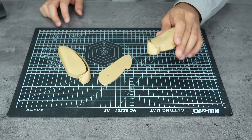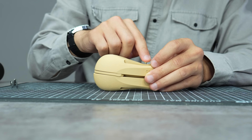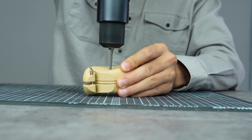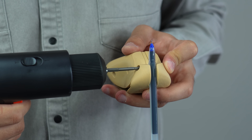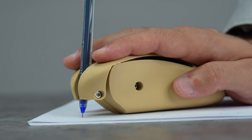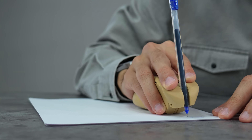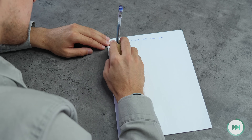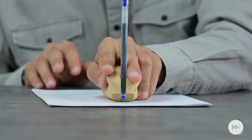Assembly is pretty simple. You just need 3x M3 bolts, and if you want, you can add threaded inserts — I added them because I have my new heat insert press. Then just tighten your bolts, insert your pen, and tighten the last bolt. Instead of holding the pen, you simply rest your hand on the Drag and gently glide it across the page like a computer mouse. Its symmetrical design creates comfort for both left and right-handed users.